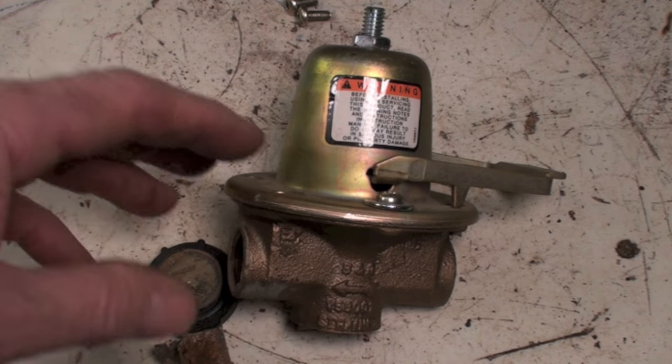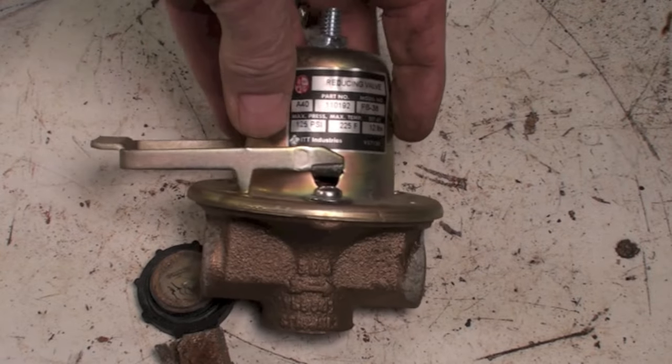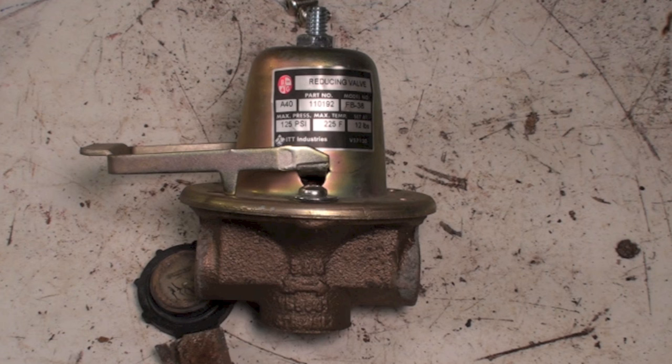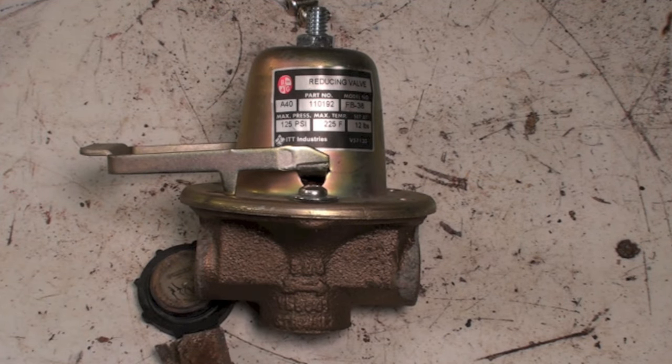It's been my experience that if you come to an older valve like this, this one's not very old, but if you come to an older valve, I usually say anything over 5 years, and I have to do work on the boiler where I have to take the water out of the boiler, I replace this valve. I've just had too many problems with them. You'll get away from it, and you'll get a call the next day. There's water on the floor because of pop-off fluid. Then you got to come back and do everything over again and replace that valve.